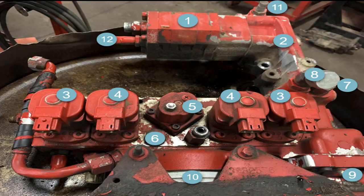Number 6 is the low-pressure fuel regulator — it regulates the pressure between 250 and 295 PSI. Number 10 is the top of the fuel filter. Number 9 is the electric lift pump assembly. On the right side of number 9 is the fuel suction fitting that goes to the line coming off the primary fuel filter on the frame — it's usually a number 10 fitting. Over on the left, that steel line with the black wrap goes to the ECM cooler plate. It runs diesel fuel through the cooler plate and back to the IFSM to cool the ECM that is bolted to that plate.